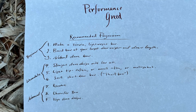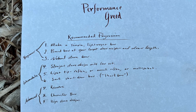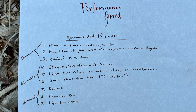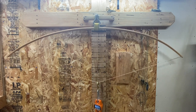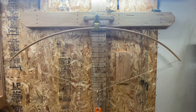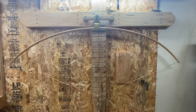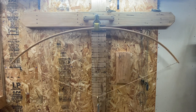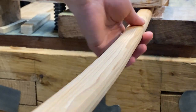Chapter 5: performance greed. When it comes to performance features, it's easy to bite off more than you can chew. You might have heard that reflex and recurves make your bow shoot faster — that can be true if you nail the design and execution, but without a lot of experience you'll likely make a better-shooting bow with a simple straight stave design. I've seen a lot of first-time bowyers make really nice straight stave bows, but I almost never see a nice recurve made on the first try. On your first bow, spend your time learning the fundamentals rather than troubleshooting advanced issues like those you'll deal with on a recurve. Once you're capable of designing and tillering straight stave bows for low set, then you'll be ready to go for recurves and reflex bows. Anytime you choose a performance feature, be aware that it adds extra stress to the wood and you should counterbalance that with extra margin for error, such as wider or longer bending limbs.